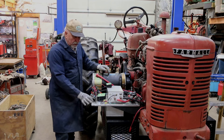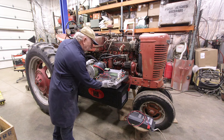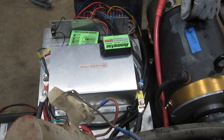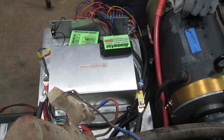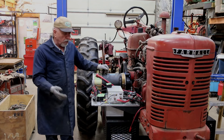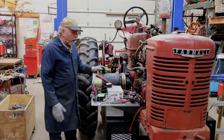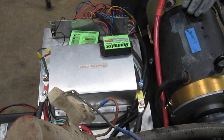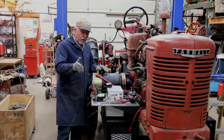I have a simple relay here that is turned on by a switch that is currently just roughed in. Let's go ahead and turn the switch on — we are going to energize this relay. Now that the switch is on, our speed controller immediately booted up. We've got to wait around 5 seconds here for the master boot. Now it's 100% ready to function. I could actually jump on the tractor and take it for a drive. It's currently in neutral — I have double verified it. I'm going to go ahead and press the throttle. It's not going to be under a load, so you'll see a little hunting with the RPM. It's not the case that it's really going to turn the current on and off trying to maintain — that's the trimming portion we're going to have to work on. It's a fine line between the heavy load it can be under and a neutral load.